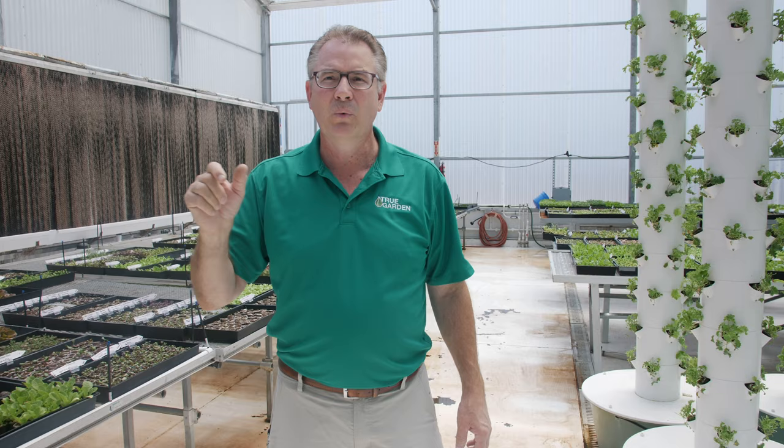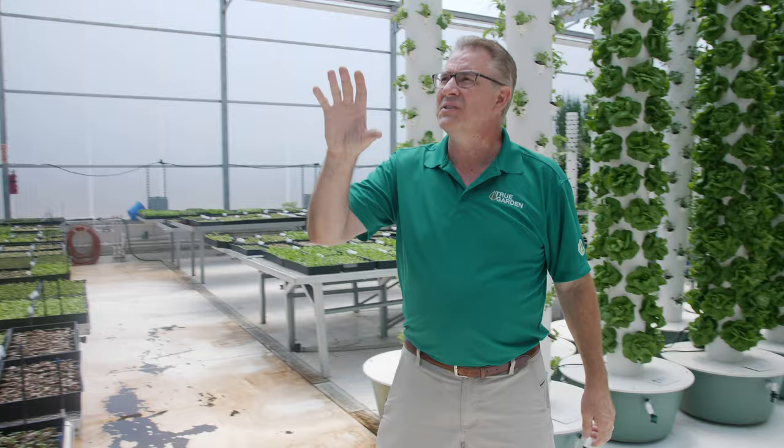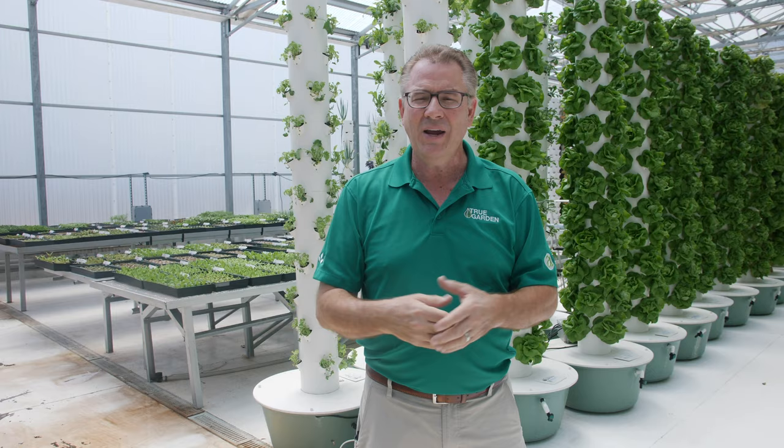This greenhouse can also be used in cold climates — that's when we put in a double-wall polycarbonate. Right now this is single-wall polycarbonate. The glass you see on the wall is single polycarb made by GE — it's a Lexan glass that is 85% light diffusing. It's actually a videographer's dream to have such diffused lighting. This Lexan glass has a tensile strength of 10,000 pounds per square inch. We want it to be strong because we have high winds during our monsoon seasons in July. This greenhouse was built to withstand 140 mile-per-hour winds.